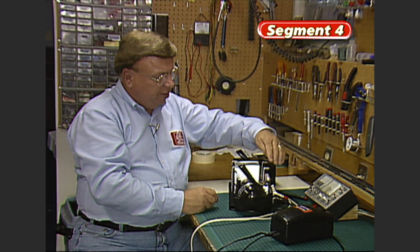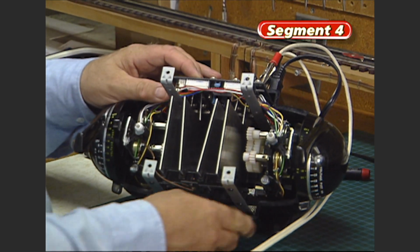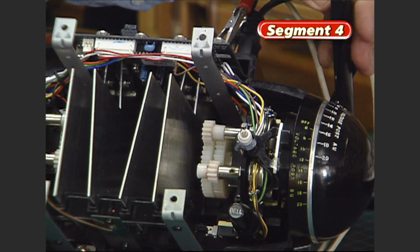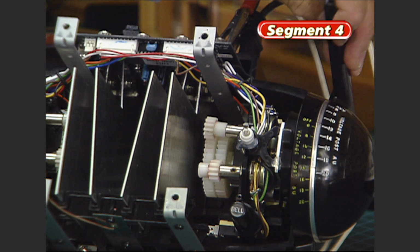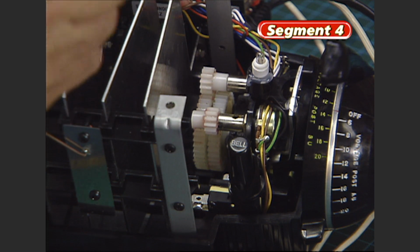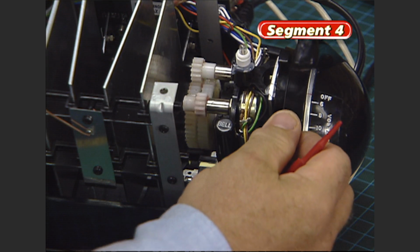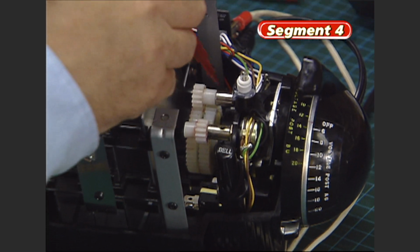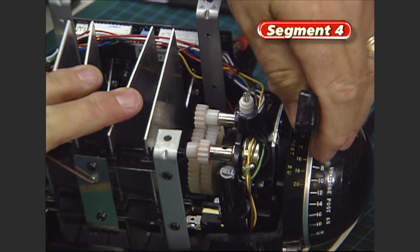What we have here are the brackets to mount it, some heat sinks, and if you look right down in here, you'll see that when the handle moves, it drives a gear, and in this case, the shaft for the gear is loose, causing the teeth to skip. What you see when you look inside is that there's 2 shafts here. This shaft and this small gear work on the big gear that the tab controls. And see how smoothly that one works? The other shaft, this one, works on the big handle, and because it's loose, you can see exactly what the problem is.